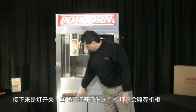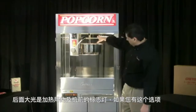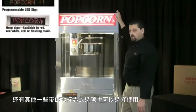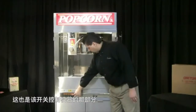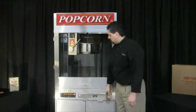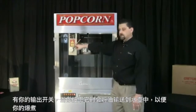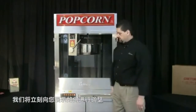The next switch is the light switch. When we turn that on, it turns on the halogen lights that illuminate the cabinet, also the heat lamps on the back side of the machine, and also your lighted sign if you have that option. There are also several other options with an LED sign which is also available. The last switch is the pump switch — that will supply power to your pump. Up on the support column, you have your delivery switch that when you depress it, will deliver the oil into the kettle for your popping. We'll show you how to make that adjustment shortly.